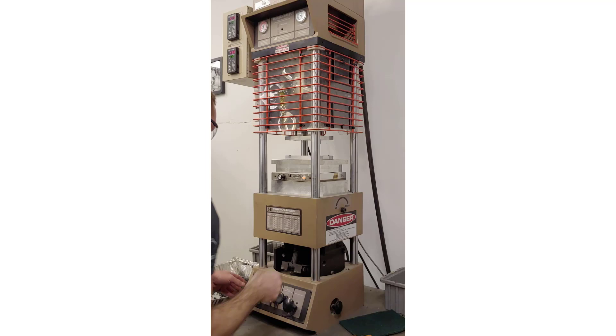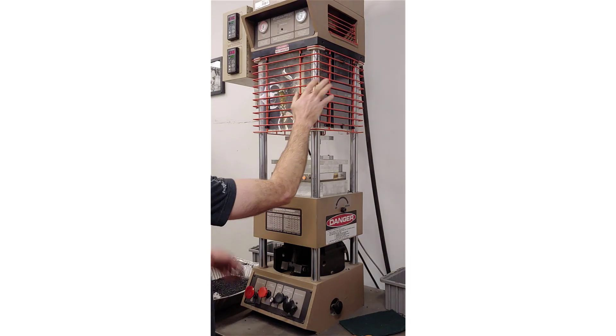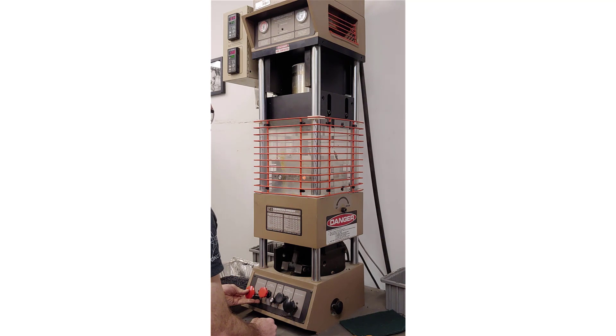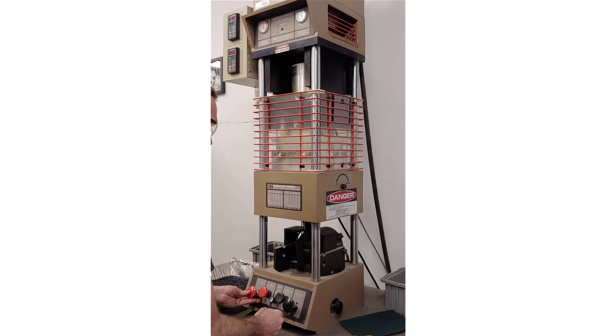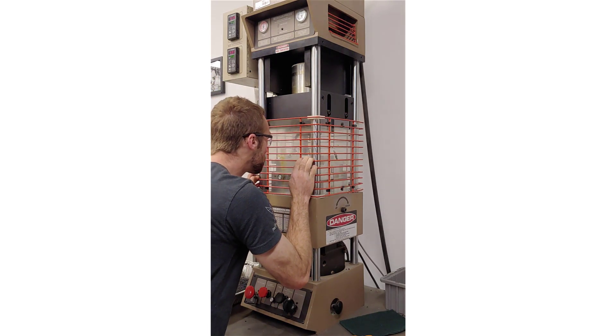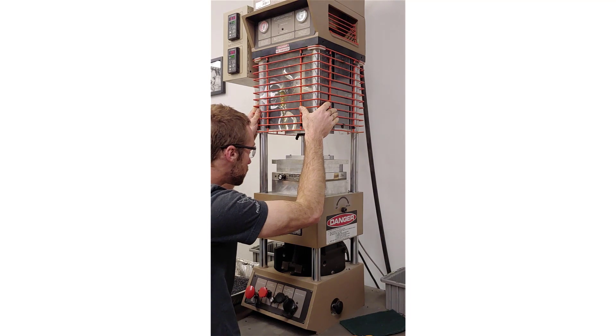Here we go through our first injection event. It is common for the first couple of injection events to produce less than perfect parts, as there may be leftover material in the barrel which has become contaminated or absorbed moisture from the air. We need to make sure the mold guard is pulled down over the mold table completely or the injection molder will not function. We clamp the mold table by pushing the orange clamp control knob, and after the clamp linkage snaps over center, we press the black injection control knob and hold it until injection is complete, then pull it back to neutral. We wait a second or two before pulling the orange clamp control knob to unclamp the mold, then use needle nose pliers to carefully remove the hot part.